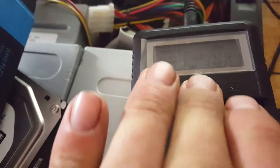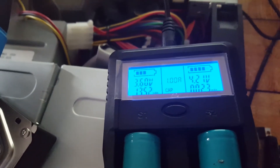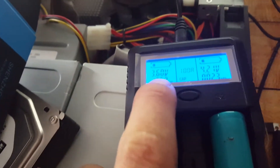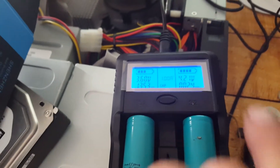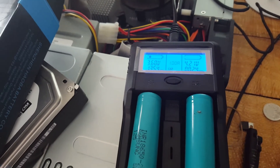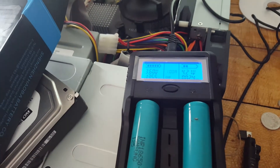You can change the current. That's what I've been doing anyway with my lipo chargers. But this does two at a time, and once it's done its capacity test, it keeps the number there until you pull the cell out. So it charges up, gets to 4.22, stops, goes into discharge. Once it's discharged, the capacity number stays there and then it recharges itself.